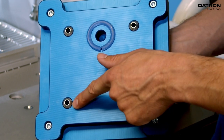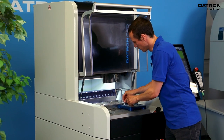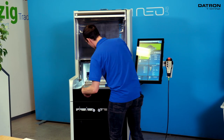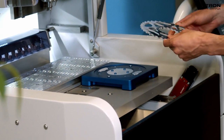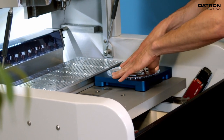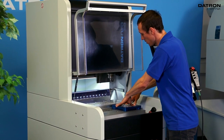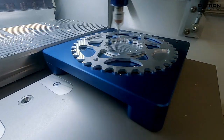With the conical inserts on the bottom plate, I can directly put it on my Neo table, put the four screws in, and make sure that my vacuum connector is set to the front row — for the first shot we had it in the back, now we go to the front row. I put my part on, so it's now mechanically located. I switch on the vacuum pump, push it down — there are no leaks, so it's properly held. And I can probe it on this cycle and start the run.